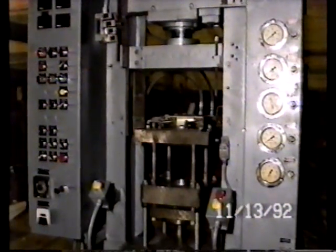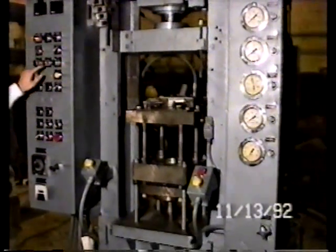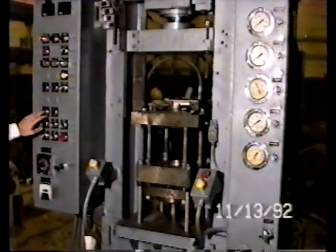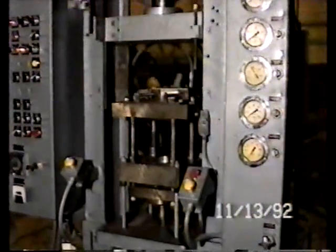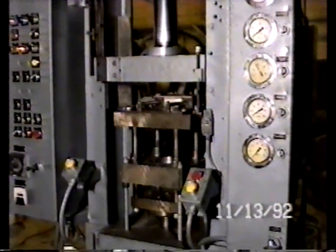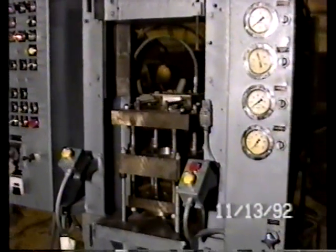To do semi-automatic, the machine goes through one cycle, stops at eject. That was semi-automatic, with the machine going through one complete cycle, stopping after it completes a cycle, and then ejecting the part. You have to start each cycle by depressing the dual palm buttons. It will cycle one time, stop, release pressure, eject the part. Would you go ahead and start it one more time, please?